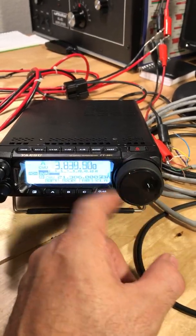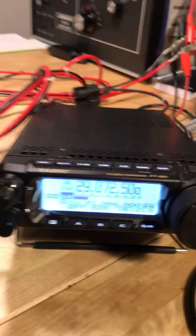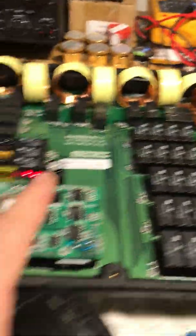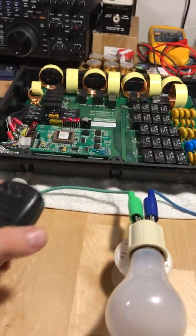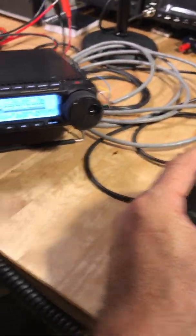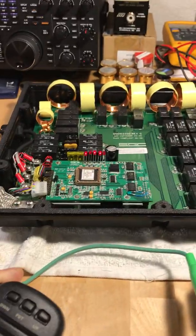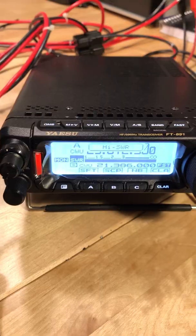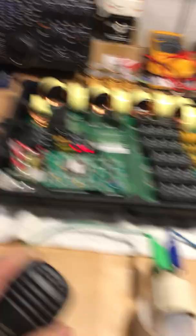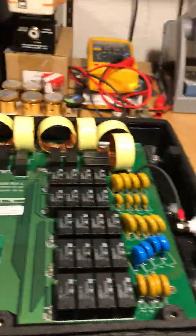It's really slow — I'm not sure I like that. Let's go to 10 meters. Same thing — really high SWR; for some reason it thinks it's still tuned, which is inaccurate, but it does know it has higher than 2-to-1 SWR. Let's key it up and hold — that's why I have it set to low power, 25 watts. Thousand one, thousand two, thousand three, thousand four, thousand five — five seconds. It didn't seem to have any memory, so it's initiating the whole tune cycle, rattling through all the different half-million combinations. Bam — okay, it found something.